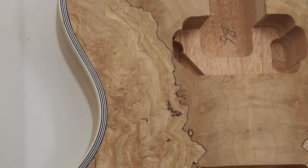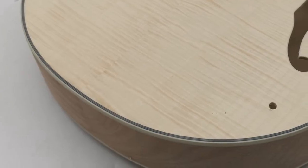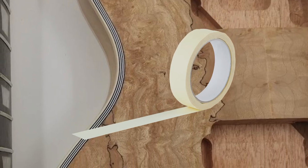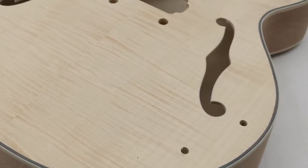Number 7: Body binding. Aside from looking great, binding protects the hard edges and prevents moisture from entering the end grains of your timber, causing swelling. However, binding also introduces the need for masking if painting or staining, which tends to make finishing a more complicated and tedious process.